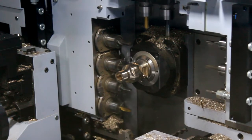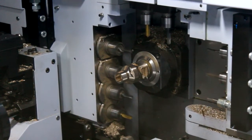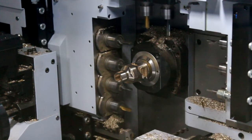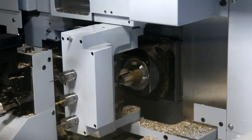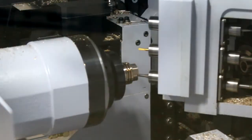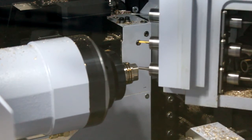On this particular model, we've got four fixed cross-working spindles, ER20 capacity, and we've got two modular stations at the top to accept our cartridge-type tooling. In addition, we've increased the number of front drilling tools from four to five, and we've got a fully programmable B-axis unit that can do simultaneous five-axis work on the main spindle or on the sub-spindle.